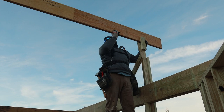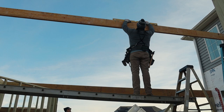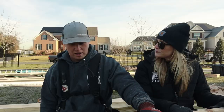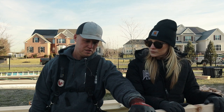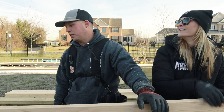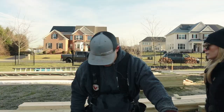Tom, what are you doing? I am putting some notches in our last rafter so it will set up to accept our show rafter while we put some 2x4 boards in there. Then we'll take a hammer to it, knock it out, and clean it up with the zippy tool. Then we'll be ready to go for the 2x4s.